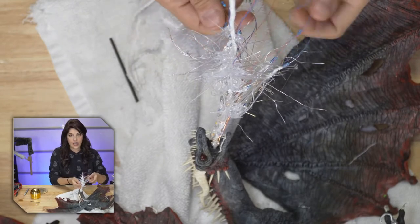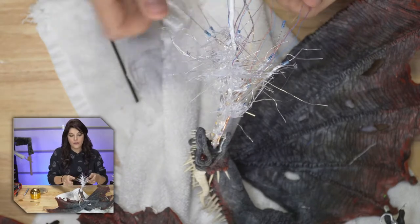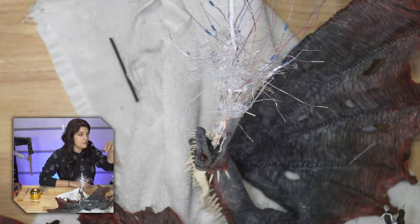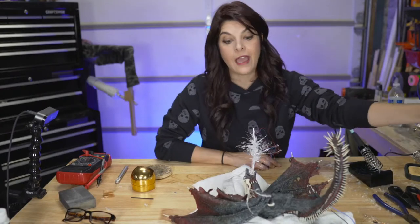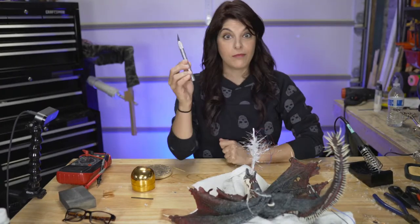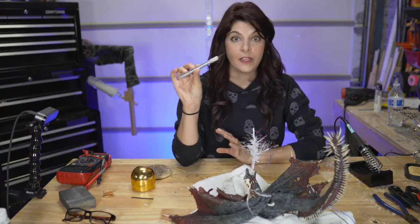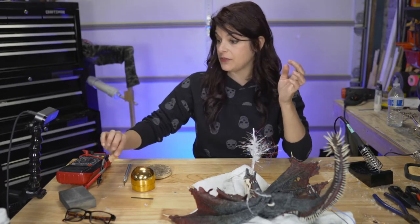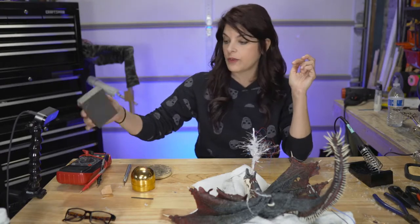As I started to mess with the wires, I noticed that the lights would turn on and off depending on the position of the wires. And we all know what that means. It means that somewhere in there, there be a broken wire. And remember how much we had to fight to get the insulation off? We tried knifing it to death, scraping it with the craft knife. I tried this sandpaper, which is maybe 100 grit, and then this very fine sanding block for paint.